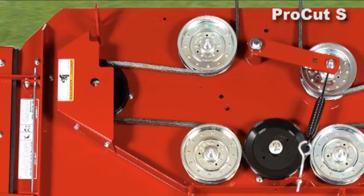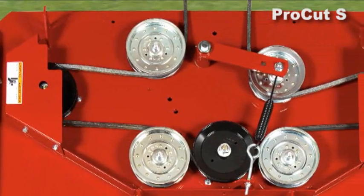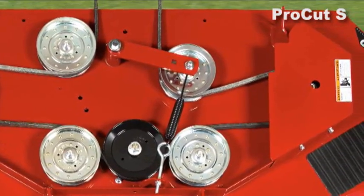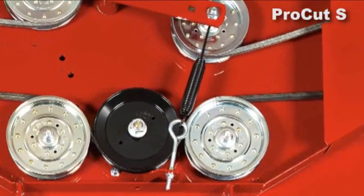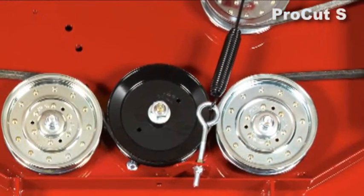Like the rest of our Ferris products, we do use larger idler pulleys and those larger idler pulleys are gentler on your belt so you get longer belt life. Also, because it's a larger pulley, your bearings are turning slower for better bearing life. And on top of the bearings, you've got debris shields. The debris shields are very important because they keep dust, dirt and water out of the bearings, so you're getting a lot longer life out of the unit.